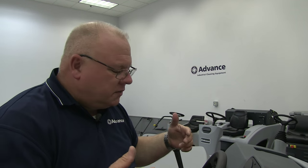The next step is to establish the proper setting of the main broom and the side broom to ensure they're sweeping correctly. For the main broom, start up the machine and engage the main broom to the floor while it's rotating. Keep the machine in one place for about 10 to 20 seconds so that the brush creates a wear pattern on the floor. Then disengage the main broom, roll the machine back a few feet, and look down at the actual width of that pattern — it should ideally be somewhere between two and three inches wide for optimal sweeping, depending on the surface you're trying to sweep.